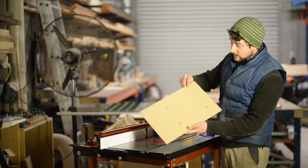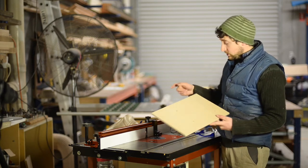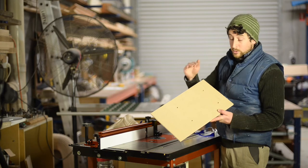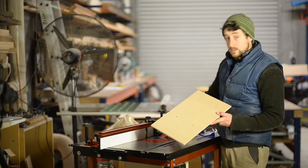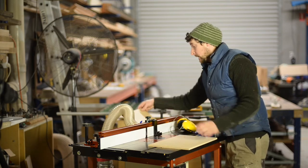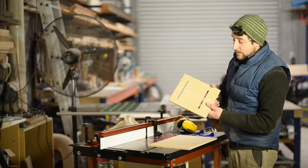So as you can see, those are our four holes drilled. Like I said earlier, you can do all of this on the drill press if you wish. You can't do this with a standard straight bit because it doesn't plunge in a straight line — you'd have to wiggle it. So the spiral upcut bit worked perfectly, and it means we can then use that spiral upcut bit in exactly the same position to do our sliding clamping plate.